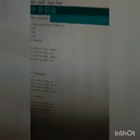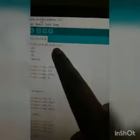Basically, if one pin is 0 and the other pin is 1, it will move forward. And if the first pin — that is pin 5 — is 1 and the other is 0, the motor will move backward. This is how you make it move forward. The same logic applies to the right motor here — they have this pin number, and they will basically move forward.